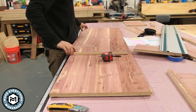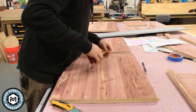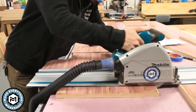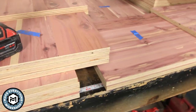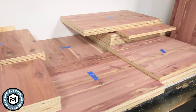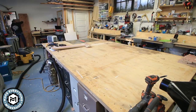That little track guide worked out really well. On the last cabinet I actually didn't measure - I just used the previous shelf as a guide and used a box cutter to score the shelf. All in all, with about 50 different pieces in terms of all the shelves and cabinet sides, everything was cut up really quickly with that track saw setup.